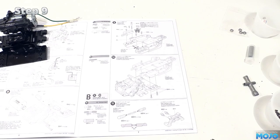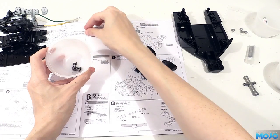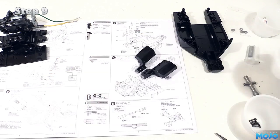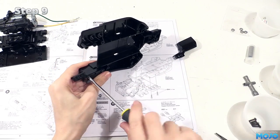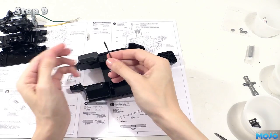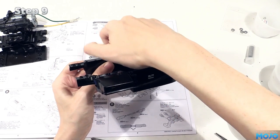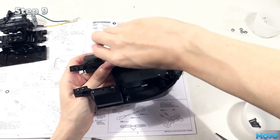Step nine. For this we'll need the main chassis, E2 and E3, three 10mm self-tappers — or four if you don't want to use the antenna mount — the antenna mount itself, and the M3x12 grub. On the right side E3 sits on the chassis and gets a screw in its two outer holes. On the left side E2 goes in. If you are using the antenna mount there is a self-tapper for the rear hole. For the front we need to fit the grub screw — we want it to be roughly halfway in. The antenna mount screws onto the grub; to tighten it the Allen key at the base of the slot works a treat. If you are not going to use the mount, just install two self-tappers just like the other side.